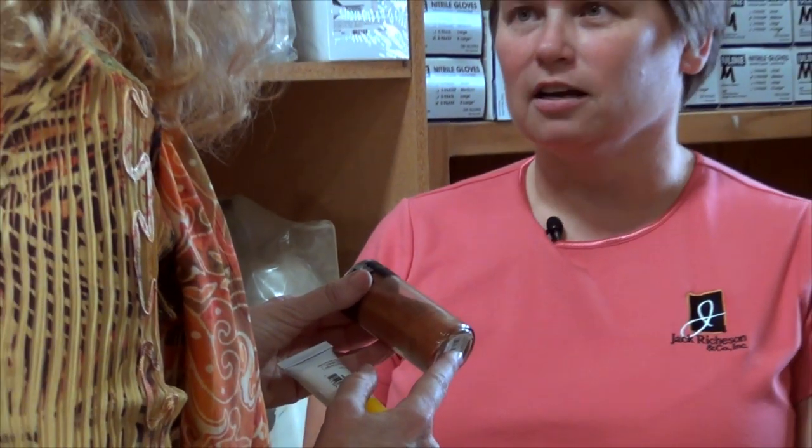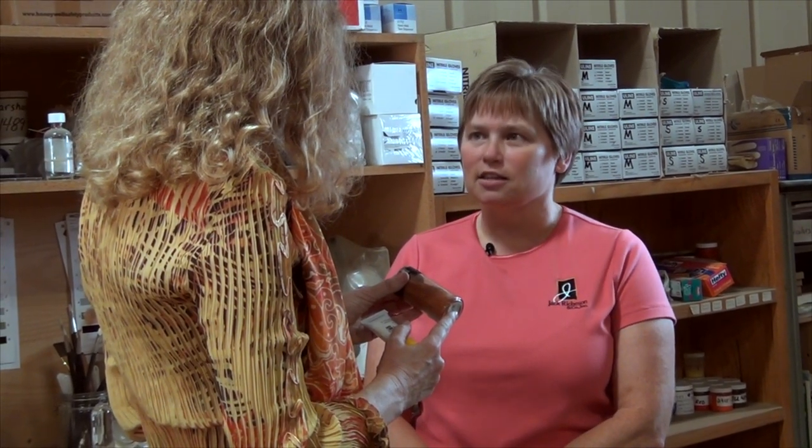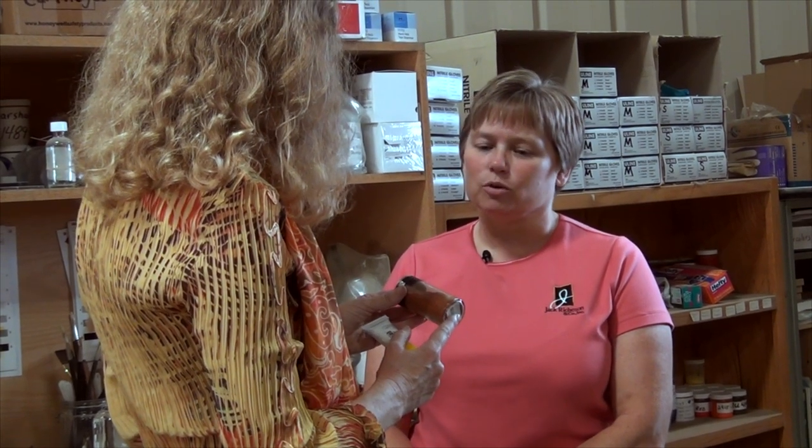I like your quality control here — you really have your eye on everything. We do. We choose to make smaller batches so we can actually control them much more. Earlier you were telling me about a part of the process called calcining. That's how raw sienna gets to burnt sienna — the manufacturer actually heats the raw sienna up to a certain temperature, and as it calcines, it becomes darker and darker, which gives us the wonderful reddish-brown burnt sienna we know today.